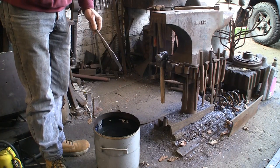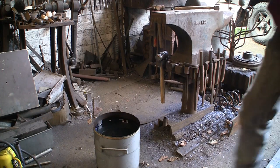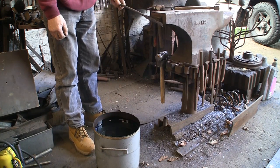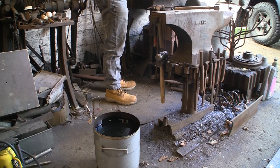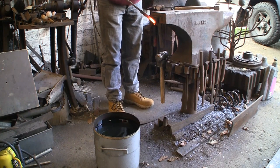I'm getting this hot. I've just kept the actual hook out of the hottest bit of the fire because you can see that's already got really hot, so I was keeping the coals off that hook I've just made. I've just put a little bit of shape in it — just a tiny bit — just so that it runs smoothly across the sole of the hoof if I need it to. So I've got my oil can out. Now, some of you may have said 'oh you're doing stuff near a gas canister' — well it was a gas canister but it didn't have anything volatile in it. It had Freon I think, for air conditioning units. I cut the top off it and filled it with oil, and I use it for quenching.